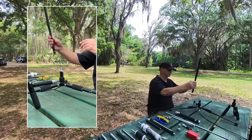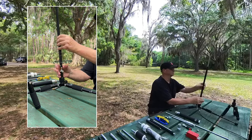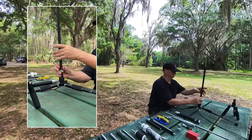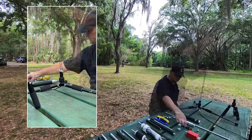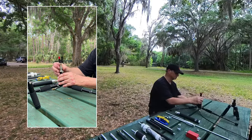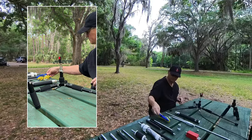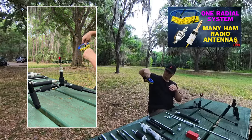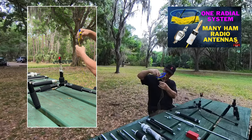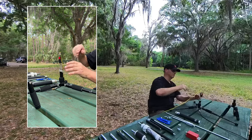If the Toybox antenna is your thing and that's how you want to POTA or prepare for emergency communication, it too has a UHF connector and it will work with this tripod system. With the right adapter and the dipole connector, you can run wire antennas using this tripod system. You can take the HOA HAM method of ground radials and take that banana plug adapter and put it into the ground side of that dipole connector and then run your wire up to a mast or a tree.